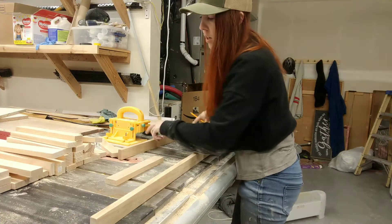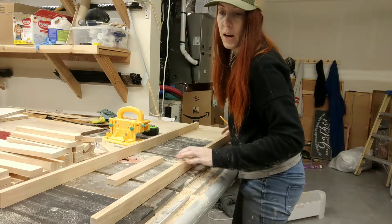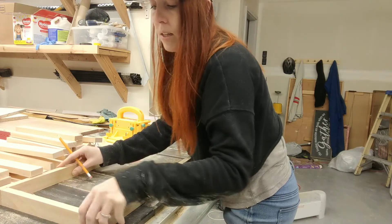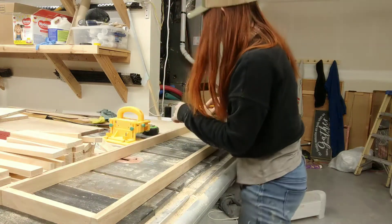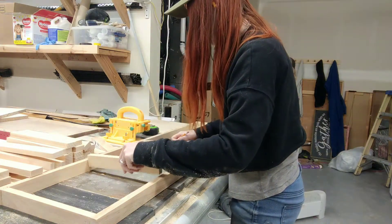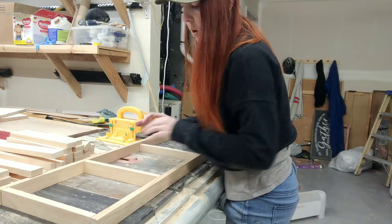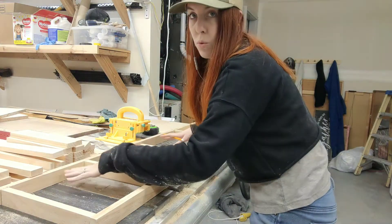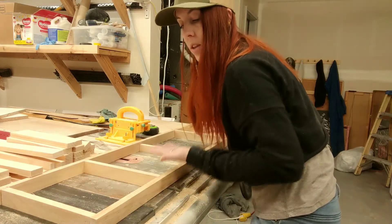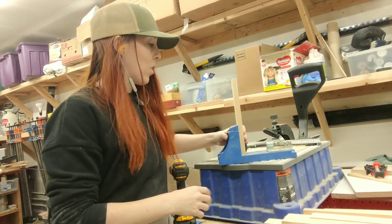For a single shelf you're going to want your two 48-inch pieces — one is going to be the back side, one is going to be the front side. I've already milled them down, they're sanded, nice and smooth. Then we're going to have all of our quarter braces — we're going to have five of them. We're going to have two on the outer edges and then space the other three in the middle. This is going to act as our frame for the shelf. This is where we're going to be able to screw the back of this frame into the studs of the wall, make sure it's nice and sturdy, and then we're going to be putting our sheet on the top and the bottom and paint it all, and we'll have a nice floating shelf look.